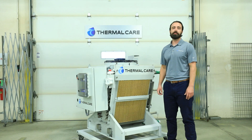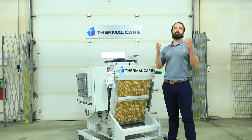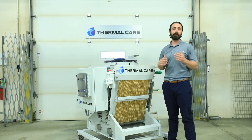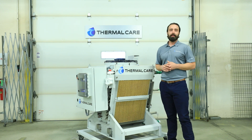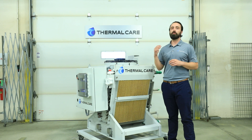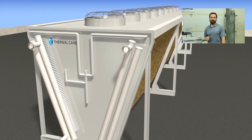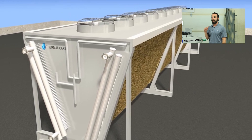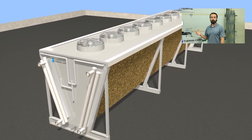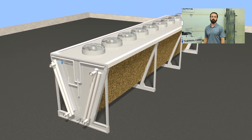The HFCG series also uses all variable speed fans. What's nice about that is a two-part system. First and primarily, it's a very energy efficient means of controlling these fans rather than cycling them on and off when you have more than one. I've seen instances where using a variable speed system versus a cycling system, you can get an additional 40% energy savings just by varying that speed. Another slightly less impactful but nice feature is that a fan is its most noisy when running at full speed, so with variable speed control you're always going to be at the minimum noise required by your system to achieve its full cooling requirement.